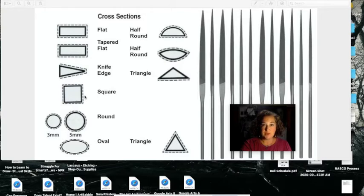You will also find in most needle file kits a square file — the cross-section is square. You'll find round files, sometimes of different millimeters in diameter, and oval files. Some of my favorite files are my half rounds — I like a half round because it has a flat edge and a curved edge. I also call another file a half round in my classroom; it has two domed edges instead of one flat and one domed. You'll also find a variety of triangular files. Technically these two different triangular files have different names, but to ease things for my students, we call them both triangular files. They're easy names to remember because they're named after their cross-section shapes.